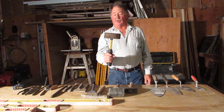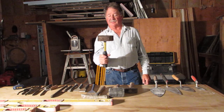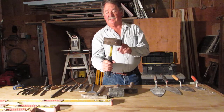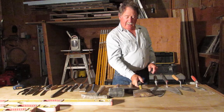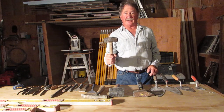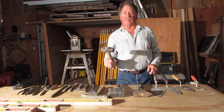This hammer here would be a stone hammer and it would be used for cutting stone, chipping stone, or dressing stone. This particular hammer has a carbide tip on this edge and a carbide tip on this edge for harder impact. Another common hammer is called a mash hammer — this is basically a two-pound sledge and it's used for working with chisels.